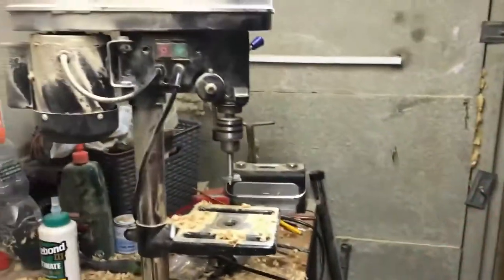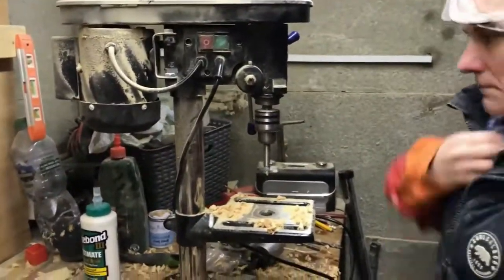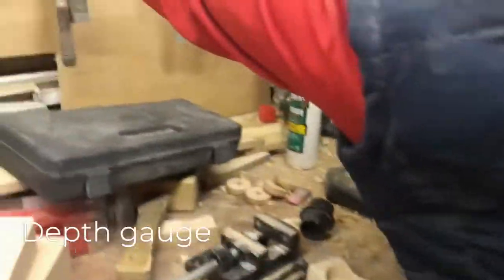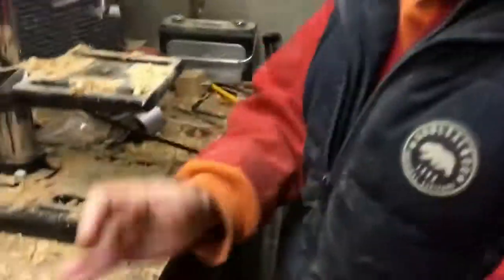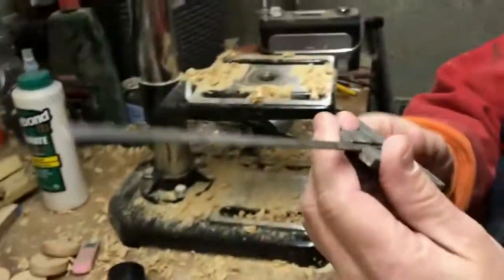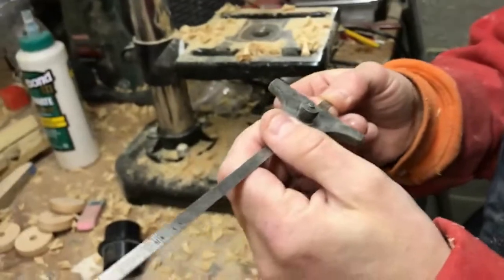Is that a special type of drill? It's a pillar drill. There's normally a gauge measure here on the pillar drill, but mine broke, so I have to guess and then use the depth gauge for the actual depth. The depth gauge is here. I'm taking it to 80mm.